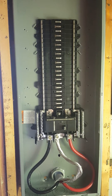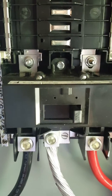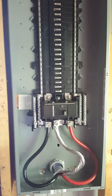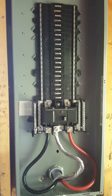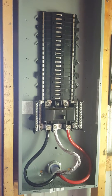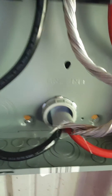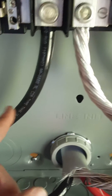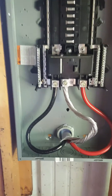We're getting a separate meter installed, and this is a 200-amp service panel — you can see the main shutoff rated at 200 amps. It's a 40-slot panel, so tons of space; I'll never use them all, but the bigger box doesn't cost much more and who knows — we've talked about putting a lift in here, a bigger compressor, all kinds of fun stuff. The box is mounted, wires are up. This is 4/0 aluminum — three 4/0 wires used to connect the service at 120 volts each.